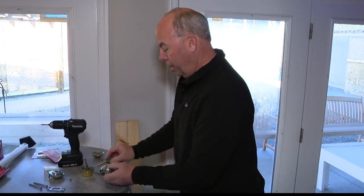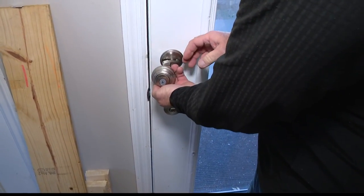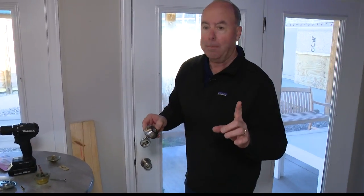There's double cylinder and single cylinder. Double cylinder means that you have a key on the inside. The reasoning to want a key on the inside would be if there's glass — just a small panel that someone could put their fist through, reach through, and open the door. That's why you'd have a double cylinder. The thing to think about though — remember this — there's always a fire safety component. You never want to trap yourself in your own house. So if you're using double cylinder, everybody in the house needs to know where the key is. Be really cautious about that and think it through.